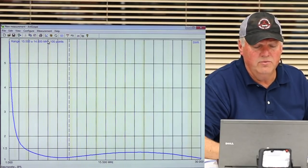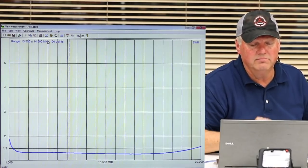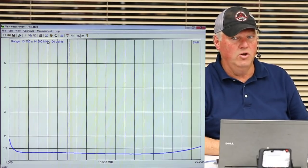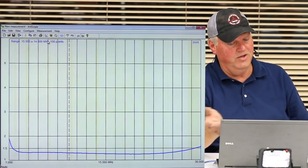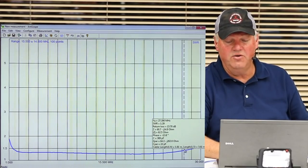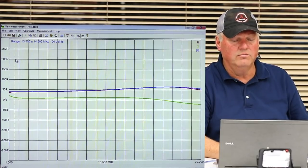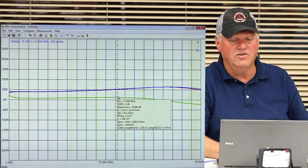Okay. So we're thinking, and there it is. Look at that. That's pretty nice. Now, it's a type 31, and type 31 behaves better where? Lower frequency. It's a different mix. And it does not do so good on what? High frequency. Yep, but look at this. It's super flat across the band, and it's still usable right through here. And if you look over here at what R looks like, not so shabby. See, the green line is our reactance, and our reactance is running really, really good.